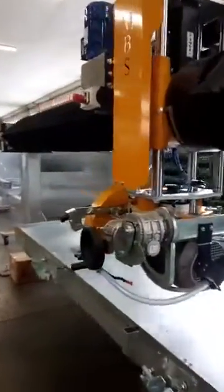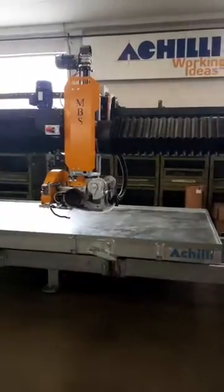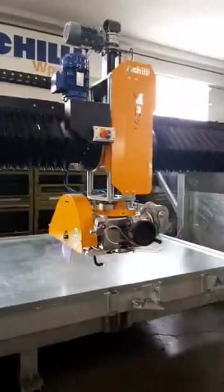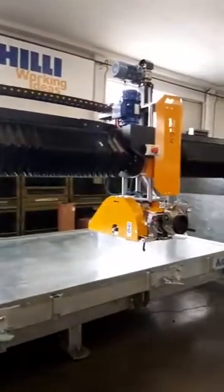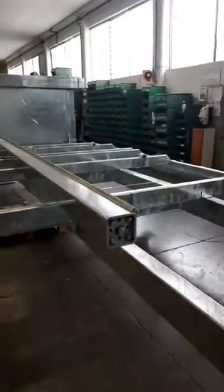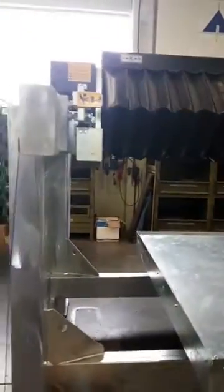Let's focus now on the MBS model. First of all, the working dimensions: X travel 3500 mm, Y travel 1930 mm. Blade diameter from 350 to 500 mm. The distance between the blade and the work table is 15 cm. The bridge, protected by black bellows, is made of galvanized steel. It is a rectified beam compressed by tensioning rods. Section of the beam is 14 x 14 cm. The head runs along the X and Y axis on steel guides with rack and pinion to ensure maximum precision.